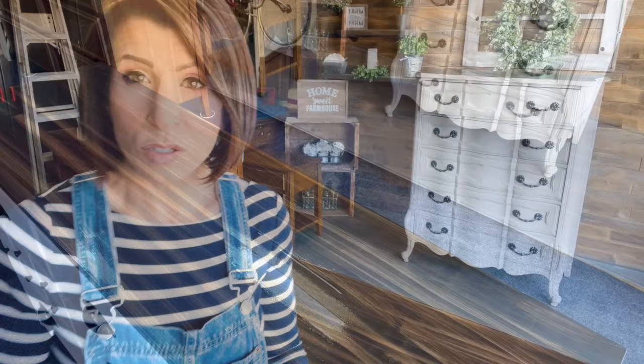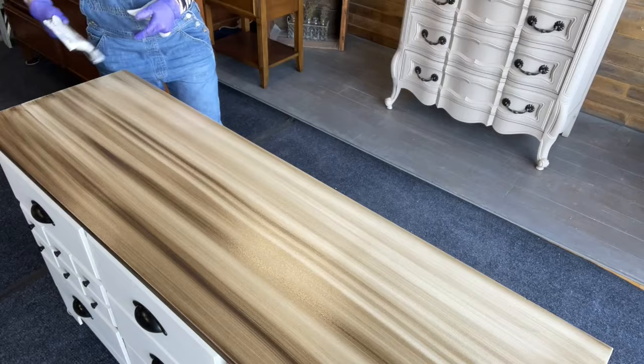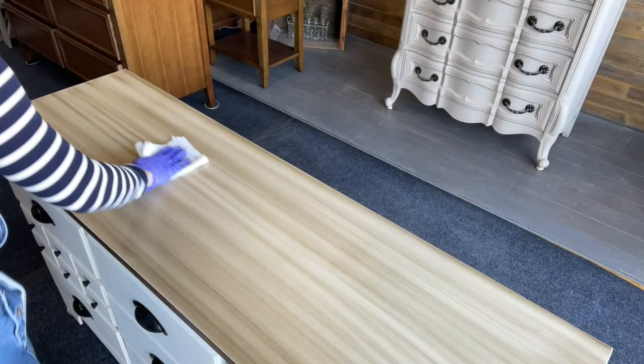I have a few minutes to talk to you guys — it is on there. I've got a 10-minute open time. The next step, the only thing you're going to need is a rag. I choose to use the white rags in the box — they work really well for me, but anything lint-free is good. The key is not exactly how you put it on, but how you take it off. I've got two rags, one in each hand, going from one end of the dresser to the other in as straight a line as I possibly can, flipping the rag so once it's loaded up I have a nice clean one, and I keep going until I get the desired look. I wanted it a little bit lighter so I continue to wipe until I achieve that.